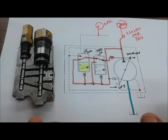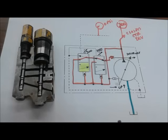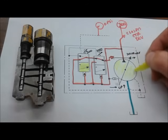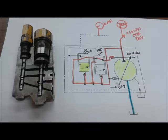If that doesn't happen, the engine's probably not going to get started because the starter motor is not going to have enough power to build up the pressure to open the pressure limiting compensator. But that's basically what happens in the pump at standby. So if I color the pump yellow to show that it's rotating, it's basically how things look at standby.